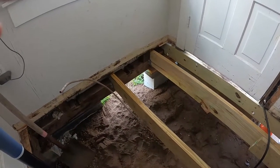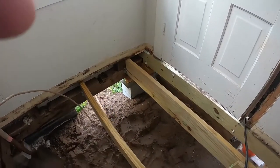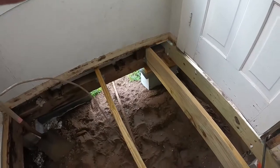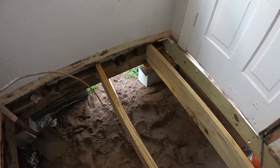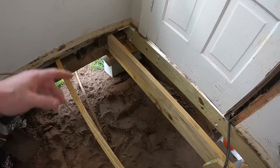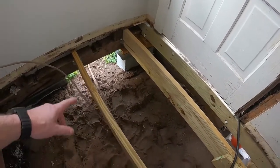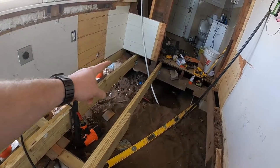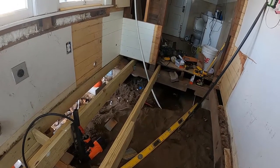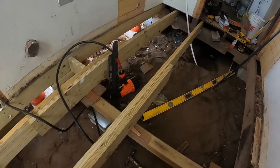We're making some headway. You'll notice the gap in there is pretty wide — I had a 4x4 right there in my way. So what I've done is set this where it had to go, equal distance all the way. This one here I set at 32 inches on center from the outside edge of the three-ply, and then I'll do 16 on center from there and marry it up.